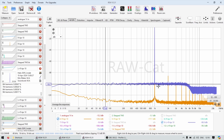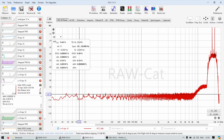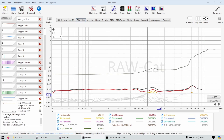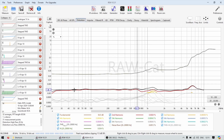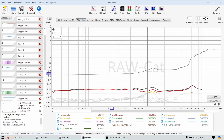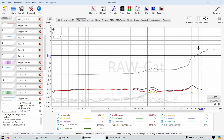Looking at the 18 and 20 kHz intermodulation, the noise is at about minus 40 dB, so the noise could potentially be audible at higher frequencies. Looking at THD versus frequency, the THD itself is down there and not an issue, but the noise rises with frequency and at higher frequencies the noise is quite high — above one percent.